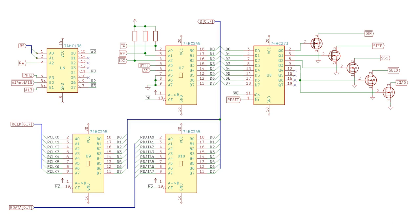I could leave it like that since 24 CPU cycles is plenty of time to read both registers. However, I can also swap these transceivers out for 74HC374 D flip-flops. These are a bit like the output register but used on the input side - they have tri-state outputs so they can connect straight to the CPU's data bus. I can connect the byte signal to the clock pins on these D flip-flops, meaning they will snapshot the state of the outputs from the shift register at exactly the right time and hold that data for the next 64 microseconds until the next byte is read.